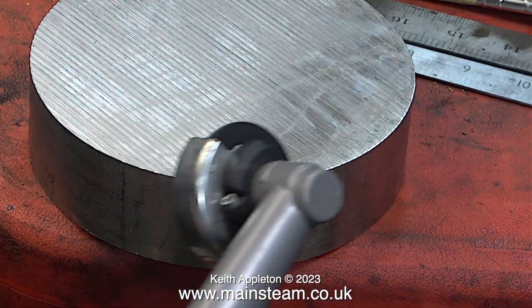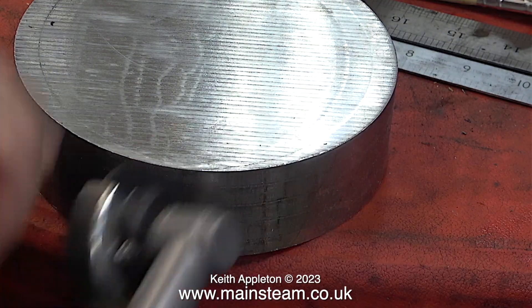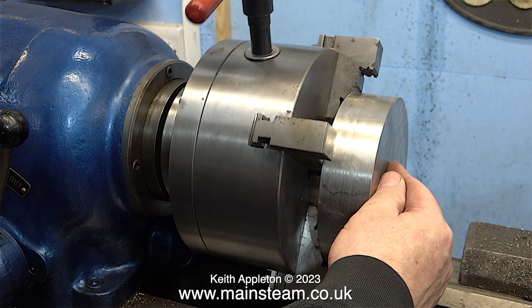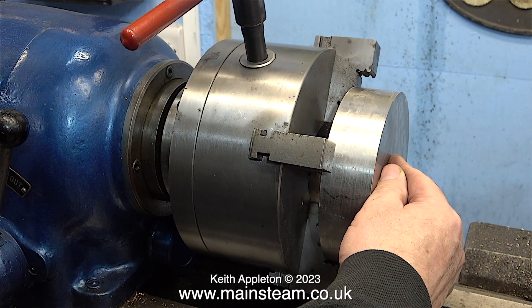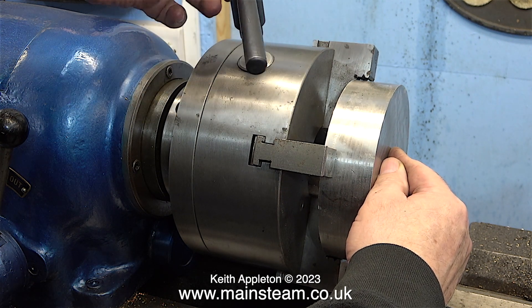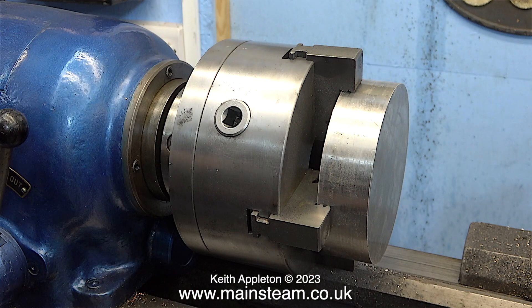In the last episode I showed myself using my Proxxon angle grinder to remove the sharp edges — this is always a good idea because you don't want to cut yourself and bleed profusely on the lathe and the workshop floor. Here I'm holding the piece of stainless steel in position and tightening the jaws onto it. I intend to face across the front first, then turn the part over so it ends up with a very accurate surface against the chuck jaws. The saw cut is pretty square but it won't be as good as facing first.